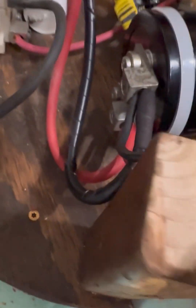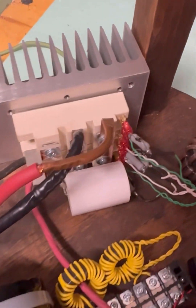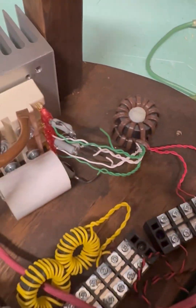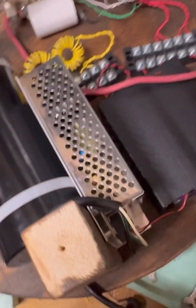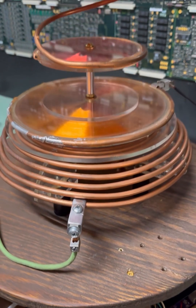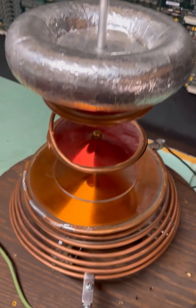This is the new build of the new setup. It's running eight nanofarads, running at about 400 kilohertz. It's using two SKM100s in a full bridge configuration with separate GDTs per half bridge. I'm using an Arduino and it's putting a PWM signal directly into the fiber optic of the driver board. I got this pancake coil to run the best, so I finally think I've found its home.